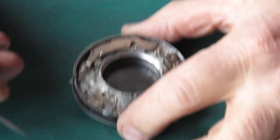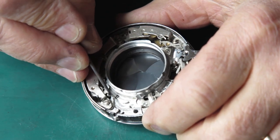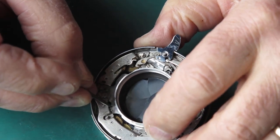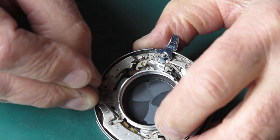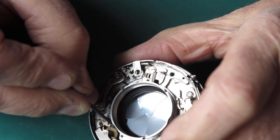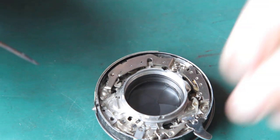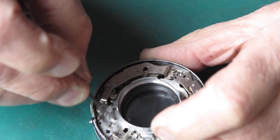There's a couple of areas I want to wipe some molybdenum paste. First, this part, that's the lever that engages or disengages the pallets. Here, this is the lever that forces the gears across this. Controls the amount of engagement here, controls what shutter speed you'll end up getting. I'll put a little touch on that catch, and here and here on there. That looks fine.